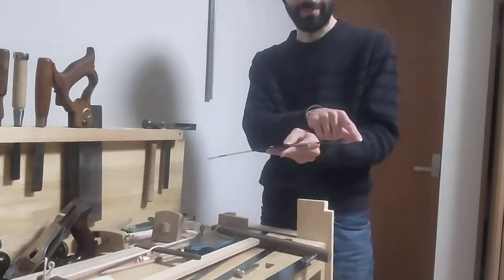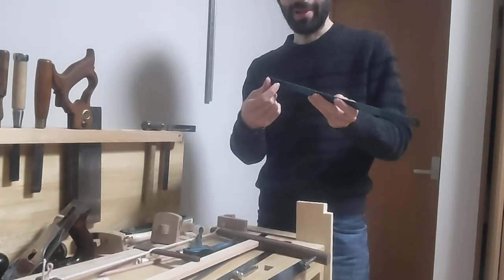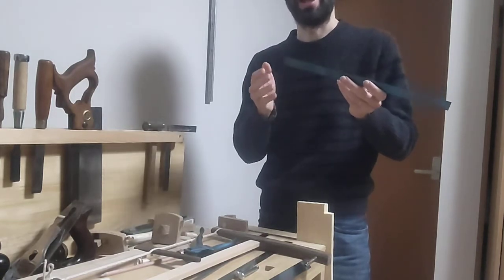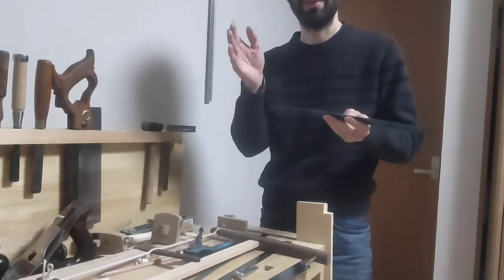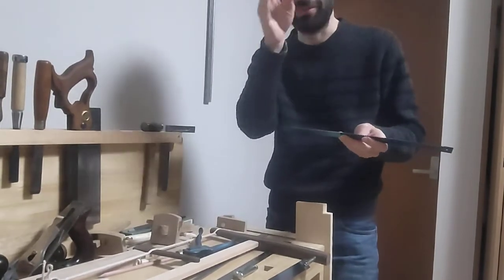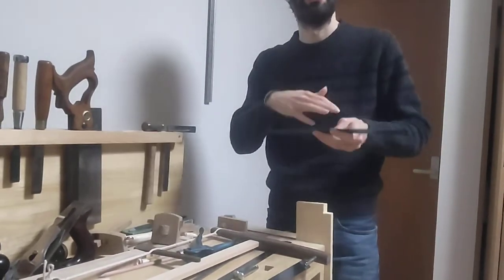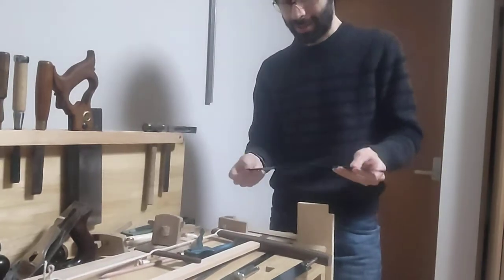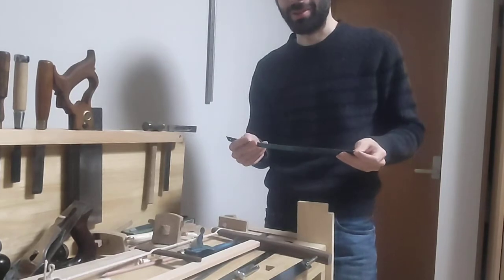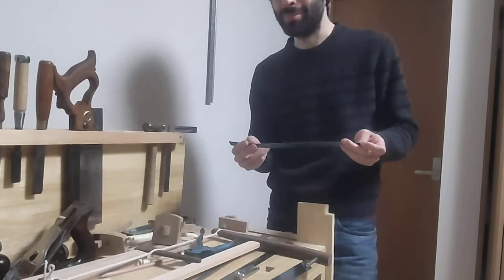What I like to do is put some masking tape down, and then I just measure out an inch, and then I subdivide that inch depending on how many teeth I want. So maybe I subdivide it at each end and then the middle, and then the middle of each of those middles, whatever, until you get the number of teeth you want. And just do that alone. That's probably the most time-consuming part, maybe even more so than filing the teeth, I'm not sure.